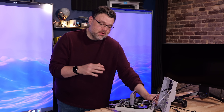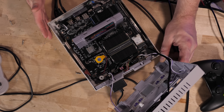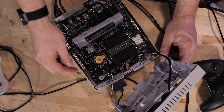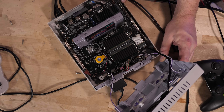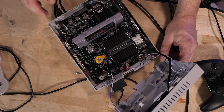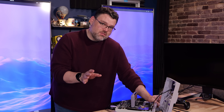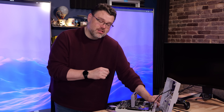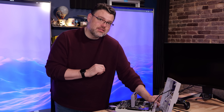If we really wanted to do this right, we'd probably desolder and re-solder, but for the purposes of this it's totally fine. This also gives us some insight about how we could do cooling a little better. If we were willing to sacrifice some aesthetics, it would cool a lot better if we opened up the sides. The sides do have a small gap for some airflow, but it really would be better if we opened them completely — maybe replaced the side with a 3D-printed gray-tinted plastic that matches but is actually an air vent. At that point it'd be pretty obvious that's not a Super Nintendo at all. But even from just a few feet away, you'd be hard-pressed to notice anything unusual unless you look directly at the back and see the ports.